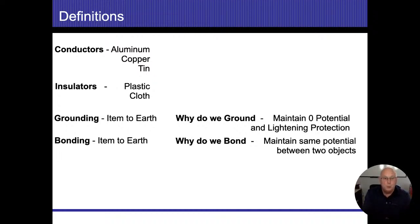All right. The difference between a feeder wire and a branch circuit: feeder wires are going to be coming from either the pole to the panel. They'll go from a panel to another panel. Those are feeder wires. Those, by definition, can actually be solid aluminum, but because of the flow of electricity, I don't think I've ever seen that much. We just can't get that much electrical flow that we're going to need in a house for those connections in a single strand. So solid aluminum, we talked about if it has the plastic insulation, solid as opposed to stranded, and branch as opposed to feeder. You should be able to identify those.